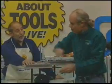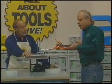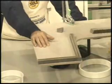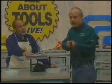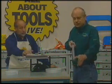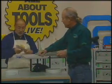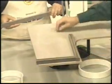So these don't have to be run back through the table saw? No, after you do it once, you just got to make sure that your rip fence is square with your T-fence. You run a board through it front to back, make sure it doesn't bind. So when you push the solid surface through at an even rate, you don't get back cuts on the back of the blade. Okay. And as you can look to see that those are perfectly smooth. Yeah, you got to get your spectacles. They are smooth. I can tell you that. Yeah, all right, that really is nice.